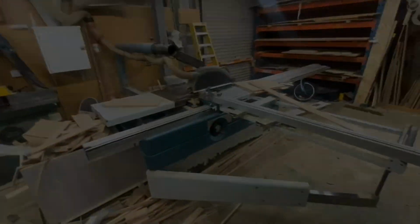And I'm going to run those through the edge bander because it's got the 40mm edging in. Let me just flip you around actually, it's easier, I can see myself. I don't like seeing myself, but it's easier. Because I've got the 40mm edging in the edge bander, it's a lot easier to run that out now rather than change over and put the 22 back in. You've got to recalibrate it a little bit, and when you've got it running really well, you're best leaving it. So I'm going to run those two bits through.